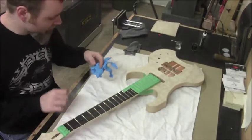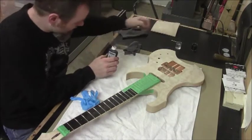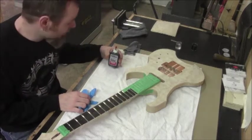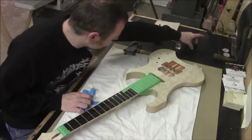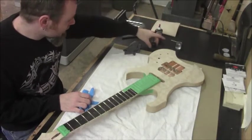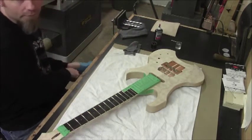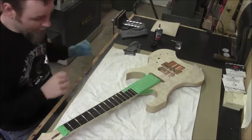Our first step here — I've mixed up some of this liquid stain. It's just a water-based liquid stain, the color tone stuff, and this stuff works very well. I use it very sparingly. I've got about a one-ounce container here, filled that with water and added about six drops of that stuff, and it is jet black — which is exactly what we want, that's what we're going for. The darker the better for this.